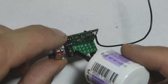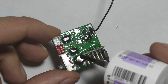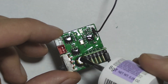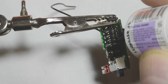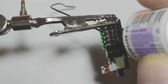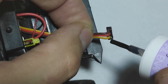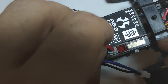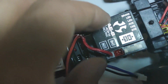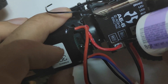Don't be afraid to use plenty of varnish and try to seal every hole you can find. However, avoid getting nail polish inside the on/off switch as it could stick the switch in place — and in the worst case scenario, if water enters the switch it can only close the circuit and act as if it was always on. The output pins on the other side are more important: use nail polish to cover each unused pin. You can also apply a sealing coat on the plugs that will be connected to the ESC. After it's dry, place the PCB inside the case, plug the motor wire, and for the battery I suggest using an extension cable permanently attached to the ESC. Apply sealant to the plugs and make sure the varnish covers all vulnerable places.